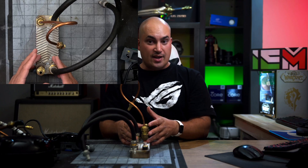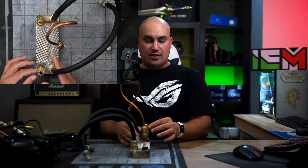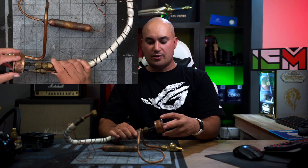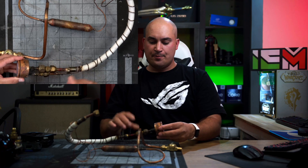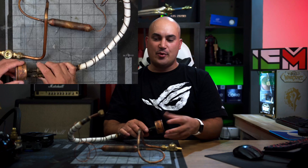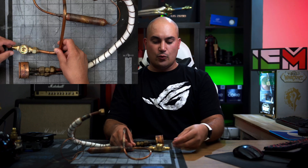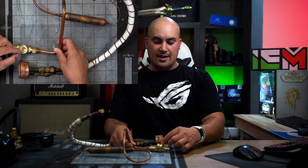So this is the first change of phase — we go from a gas to a liquid. This strange thing here is a visor glass, so we can monitor the state of our gas and make sure all we have is a liquid. If I see vapor or gas inside, I have to add refrigerant when I charge the system. I'm going to constantly look at this visor and charge the gas until I see liquid flowing.